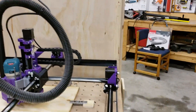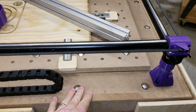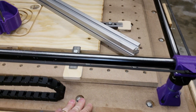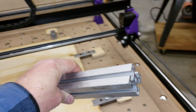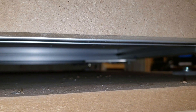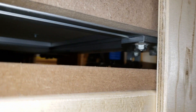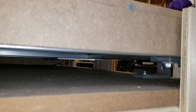The top that this CNC is mounted to is three-quarter inch MDF, and underneath it is an extruded aluminum frame — one and a half inch by one and a half inch extruded aluminum framework. I've got one piece going across the middle with corner plates, corner brackets bolting it together, and a T-bracket in the middle tying in the side bars with the center one.